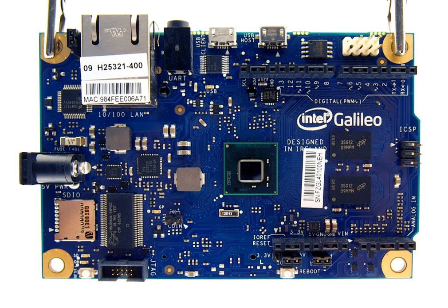The Raspberry Pi, as well as most boards from Arduino, does not have an on-board real-time clock. The Galileo boards have a real-time clock, requiring only a 3V coin cell battery. The boards can therefore keep accurate time without being connected to either a power source or internet. The Galileo can be seen as truly open source, as both the schematics and the source code are freely available for download without a software license agreement. Intel officially endorses downloading the bill of materials of the Galileo Gen 2. Some claim that hardware can't be designated open source if the processor core can't be accessed, and that the relatively closed Intel chips disqualifies the Galileo from being classified as such.